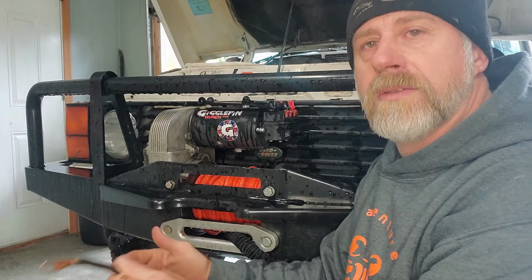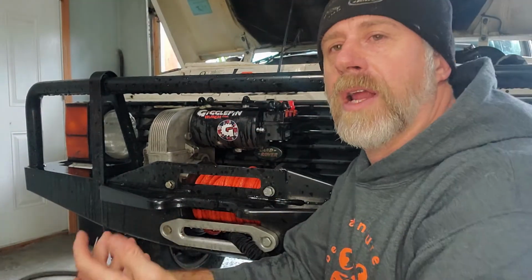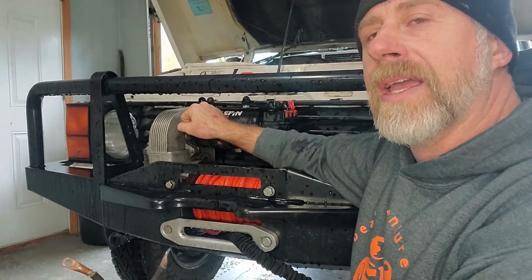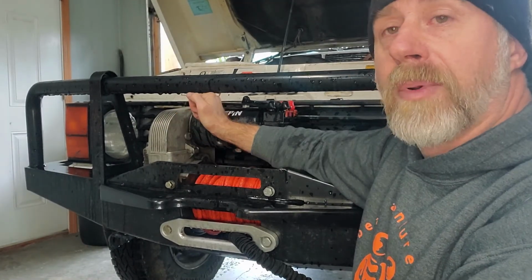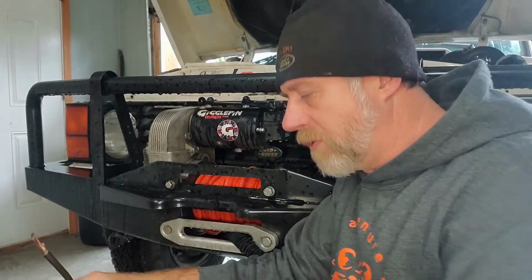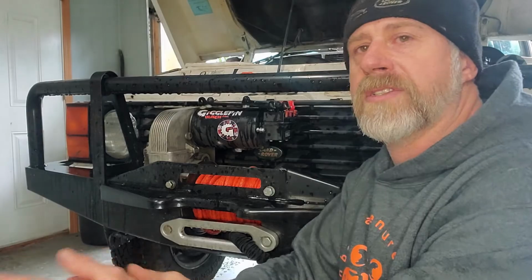If your motor doesn't work, check your ground. Same thing. Ground's got to be tight. Got to be a good ground. If you're confident with the ground, and you're not able to get that winch to move by that little trick, it's your motor. You can basically stop right there and say, okay, my motor has had it, and then go from there. If the motor spins, everything's good with the motor. Now you got to go to your solenoid setup.